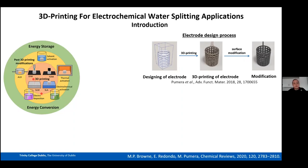FDM will be the predominant 3D printing technique in this talk, with one slide on SLM metal electrode printing. FDM uses thermoplastics to print electrodes or any shape desired. For electrochemical applications it is very effective because it is simple for novices and inexpensive — FDM printers can cost as little as ~500 euros.